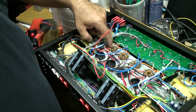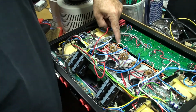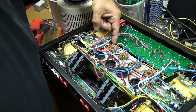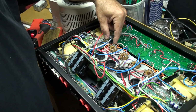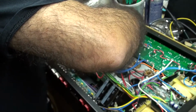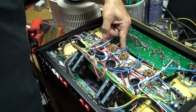I'll show you these sockets, and it's funny because the swamp resistors are actually on here on pin 5, but then they're mounted on here, right, as a stationary thing as opposed to flying up like you would on a regular Marshall. They're using pin 4. I think it's pin 4. 1, 2, 3, 4. Yeah, pin 4 as like a stationary turret, if you will, to stabilize the 1/4 watt 5.6K resistor, and this is on all of them.